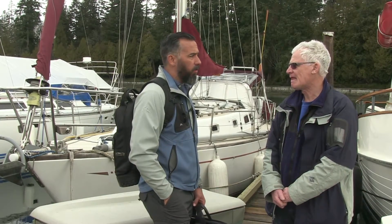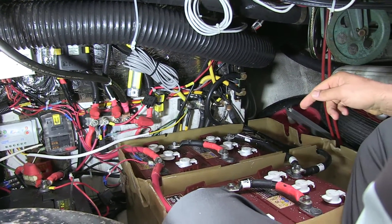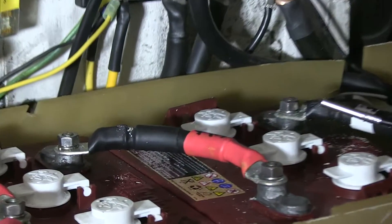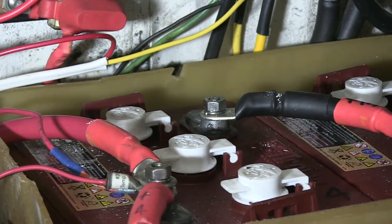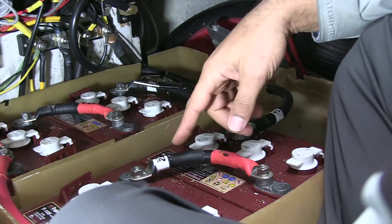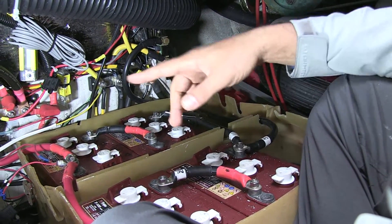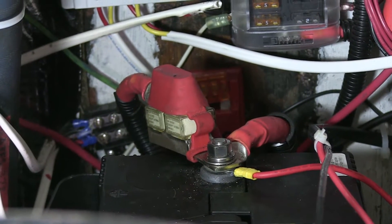Thanks for having me on board. We'll have a chance to look at it, review what we see, and make some recommendations on what's the best next steps for you to tackle. The boat is about 40 years old, pretty common setup. There's good and bad. First of all, on your boat, I'm not seeing any wing nuts on the batteries. That's one of the things commonly seen — people buy batteries with wing nuts, thinking if they came with it, it's probably a good idea. But the reality is a boat has tons of vibration and you really don't want any wing nuts on a boat, period. Also noticing you've got lock washers underneath pretty much every one of the nuts, which is great — really good connections on both the house and the engine battery.